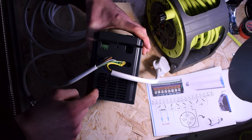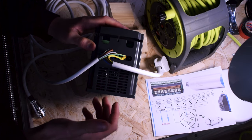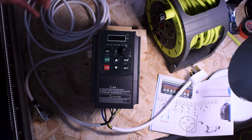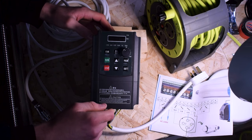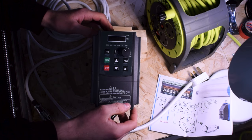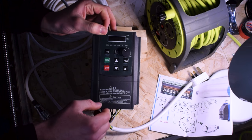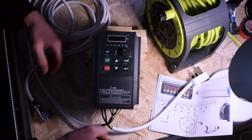Inside the VFD there are some serious capacitors — likely very high voltage, and large, which means they can store a lot of charge. Be very careful after disconnecting. You can check there's no power by trying to turn it on again. Same as a TV where the standby LED stays on even after being switched off at the wall. Make sure it's fully off before changing any wiring.